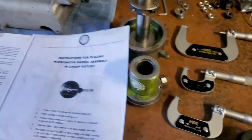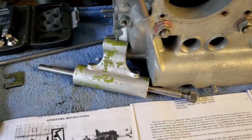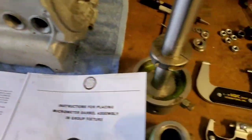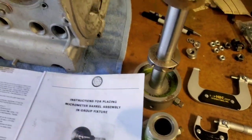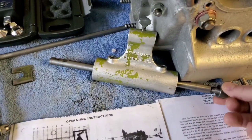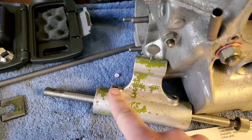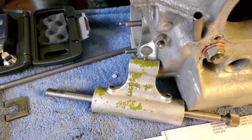This is the older of the two versions that Port-a-Tool offered. The earlier version has this hydraulic feed unit. The later style was actually built right into the rear bushing. But this works quite well actually. This little knob here engages and disengages the hydraulic feed. It just takes 30-weight oil — take out these two grub screws, make sure it's all the way full, work the air out, and that's good to go.